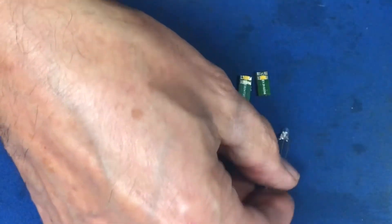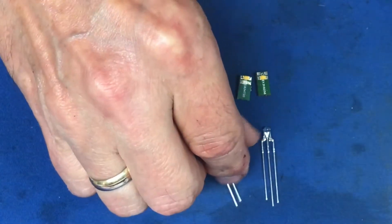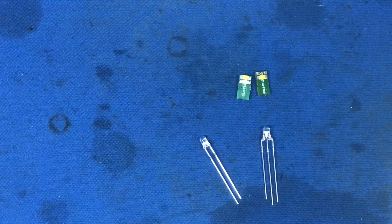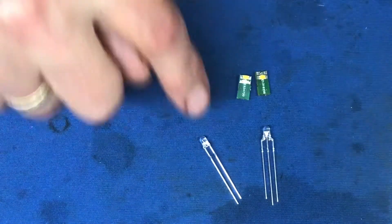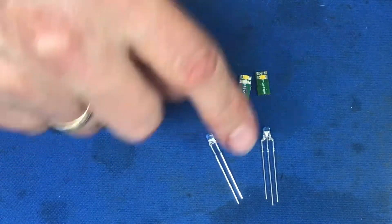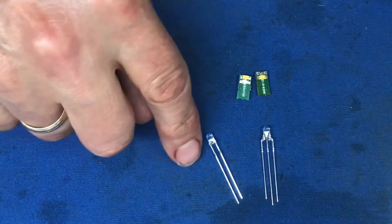I then changed my mind and drove to the electronics shop near Kreuzau. I got myself these duo LEDs and once these warm-white simple LEDs, all in 3mm diameter with round tops. The glass bodies I will now use. In the middle is of course the plus lead; on the other one the plus lead is here too. I still need to solder resistors on - 1000 Ohm each, which I picked up - and then connect them to the outputs.